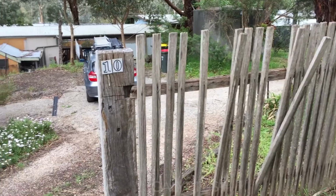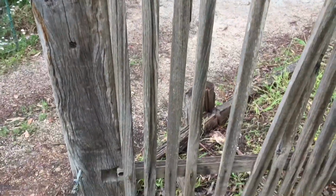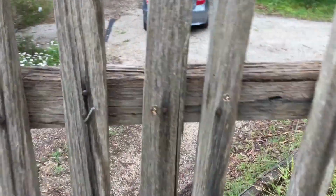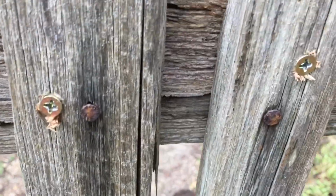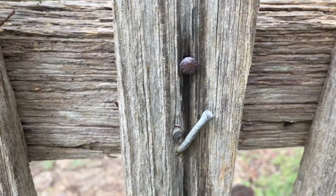But the nailing's not going to work because that top rail there, as you can see, isn't terribly well affixed and the post isn't tight, so I'm going to screw them in because they can't actually withstand the banging. So put a couple in here that I've screwed in through to the hardwood. I've just pre-drilled it and then screwed it in.